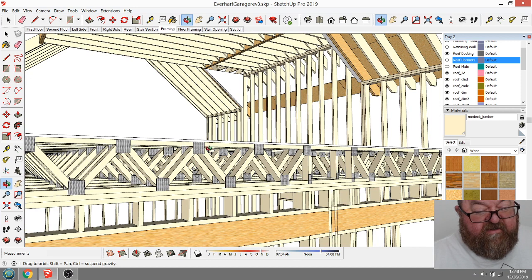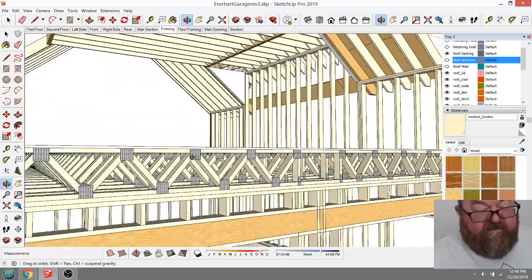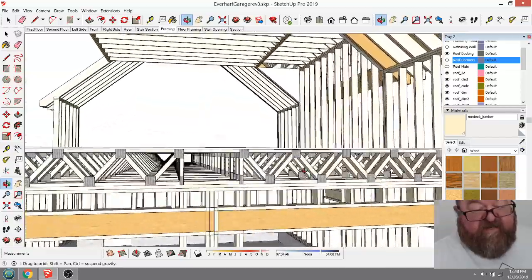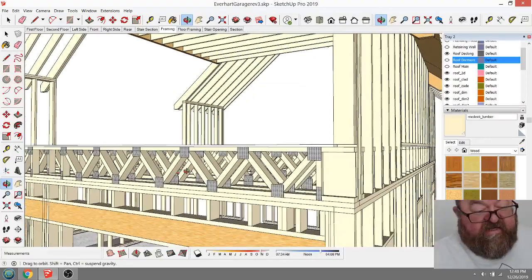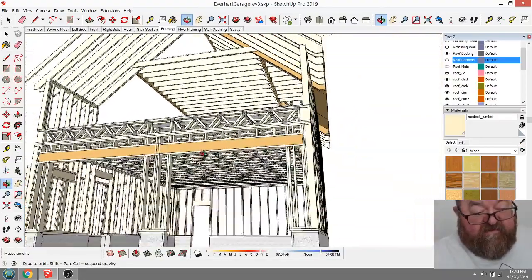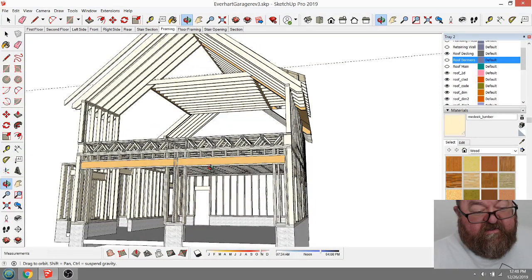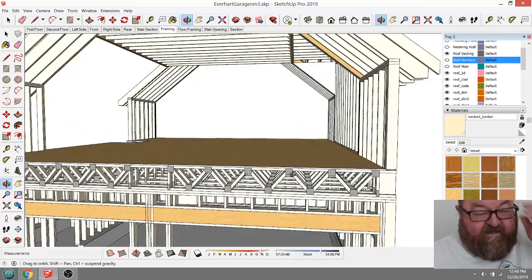So the best thing about floor trusses is that because of the way they're made with these webs and these configurations, these 45 degree triangular configurations, it distributes the load across the members evenly, pretty much. And so there's so many advantages to floor trusses, especially at longer spans. Well, first of all, if you notice, we don't have any columns in our garage to run into and knock down. So these are clear span, and they're also wide.